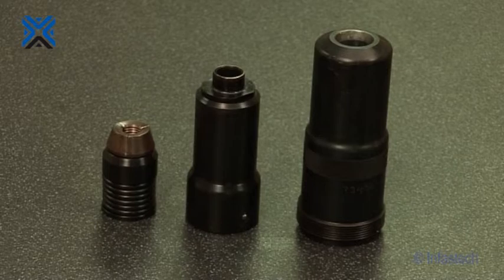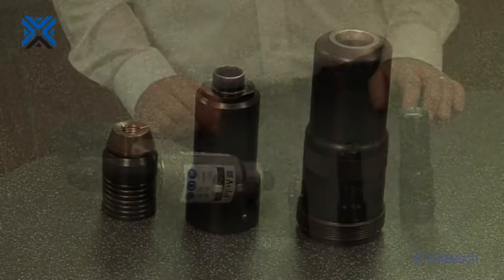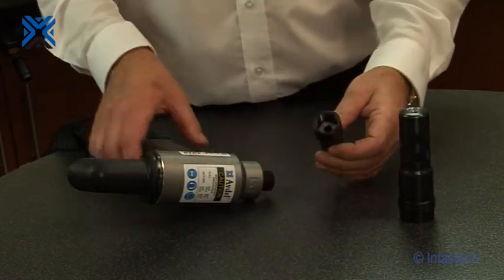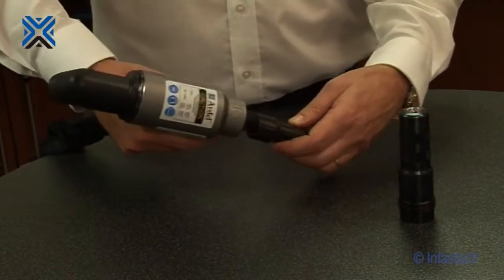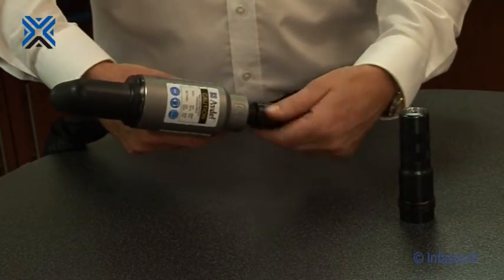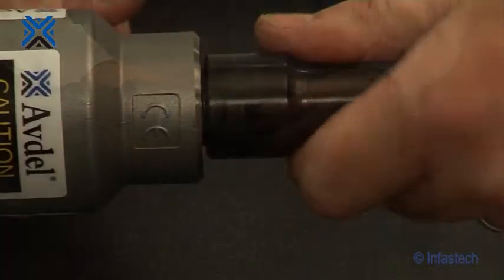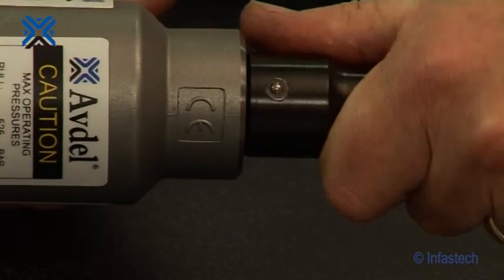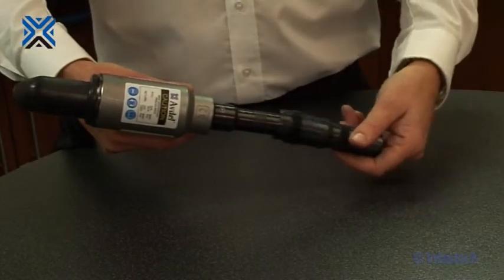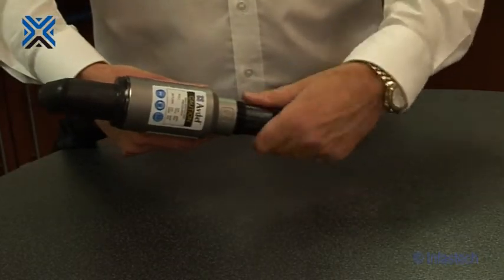All the equipment is now primed and set, ready for assembly. Assemble the nose assembly as per the nose assembly data sheet, making sure all components are present and in the correct orientation. Holding the placing tool pointing down, screw the assembled collet fully onto the piston rod until it is flush with the end of the collet. Insert the collet lock by turning the collet until it engages, making sure the collet lock is flush with the collet. Slide the anvil over the collet and fully tighten down.